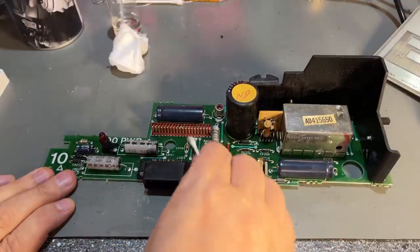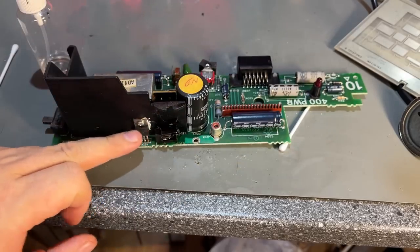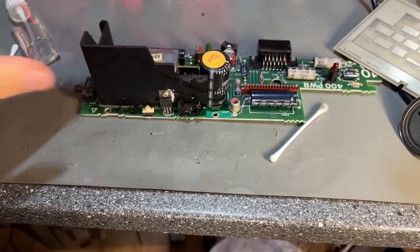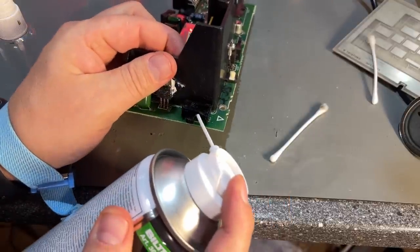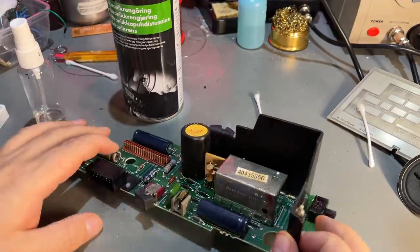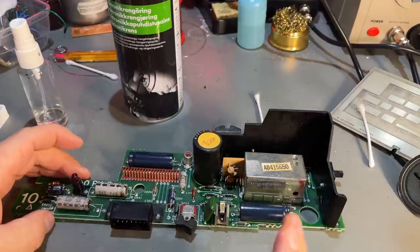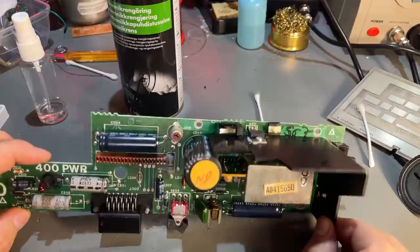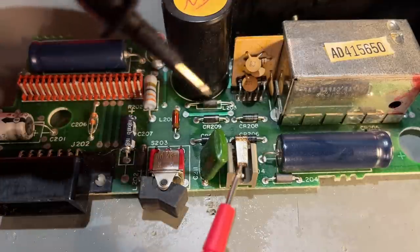This board is quite dirty and that little micro switch needs a good cleaning. There are a couple of voltage regulators - a 7812 and a 7805 - so 12 and 5 volts regulation. Applying some electronic cleaner to the dirty areas. If you want to do some future-proofing on this machine, this is where to start - by replacing the caps and replacing the voltage regulators, even though they are working. I'm not going to do anything with that now - it can be done later if necessary.